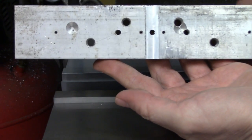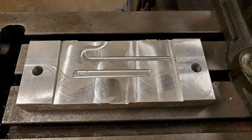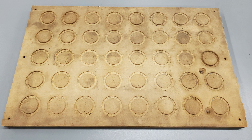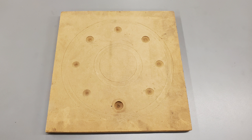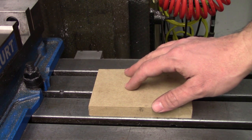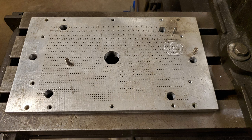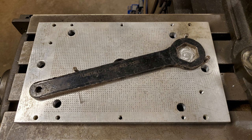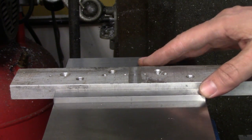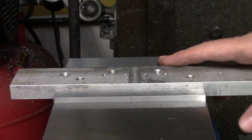Fixture plates have no definite shape or size but instead are made up depending on your needs. They can be made out of any handy material, but most often aluminum is used due to its low cost and ease of machining. If used for large runs of parts, steel might be considered instead, especially if it will be necessary to install and remove screws for each part, since threads in aluminum can be stripped out easily. For quick, sacrificial fixtures — especially for one-off parts where no coolant will be used — you can use plywood or MDF, which is medium density fiberboard. This is exceptionally flat, so it's a really good option for quick and dirty fixtures. The key feature of a fixture is that it provides a repeatable location for your part and doesn't interfere with the machining operation. Repeatability can be achieved using dowel pins to form three points of contact, or by machining a pocket into the fixture itself. They are considered sacrificial in most cases, so it really doesn't matter at all if you cut into the fixture while machining your part.